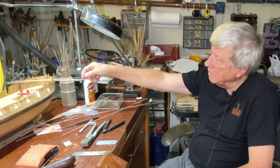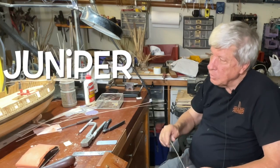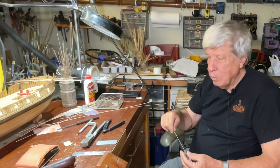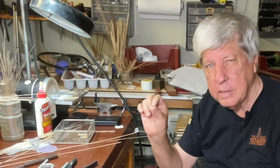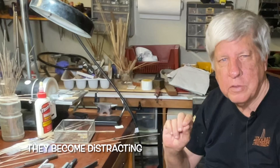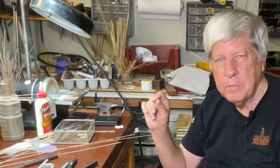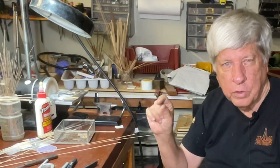I'm using the same wood — juniper — to make the tree nails so that the tree nail will actually match the wood grain that's there. Some of you may want to use a different color to accentuate it. These, for instance, are purple heart. It becomes so dark and noticeable that I decided to let my woodworking judgment prevail: whenever you're doing a tree nail or putting a cap on a screw hole on a piece of furniture, you take the same wood, line the grain up, and match it. I'm sure that's what the old woodworkers would have done.